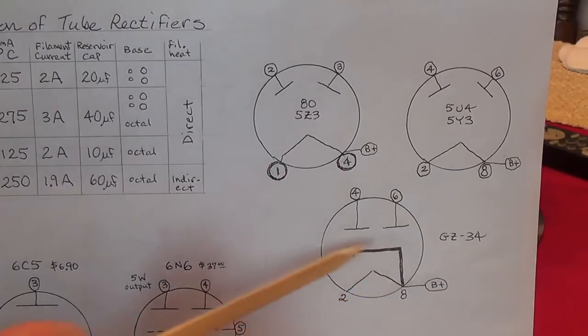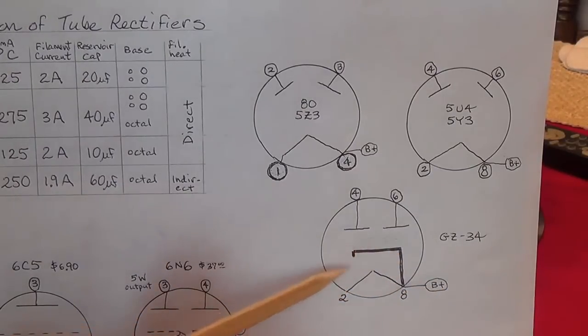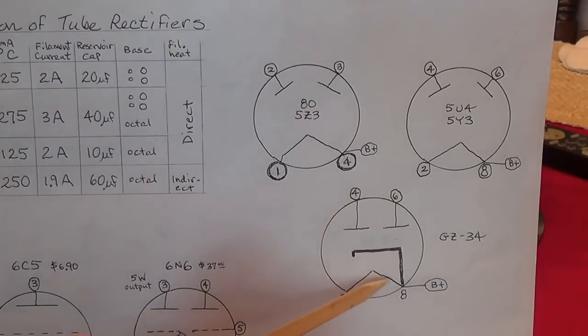If this confuses you how this can happen or work, please see a video that I posted about rectification and rectifier tubes in a previous video. I go into greater detail. Okay, but for now, you see that there is this latent period where we start the fire down here in the filament. It takes it a while to heat up the cathode. Emission starts in about 10, 15, 20 seconds. It's sort of like a built-in standby switch. You get a slow startup when you use a GZ34.